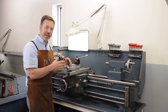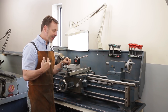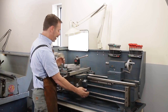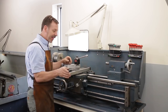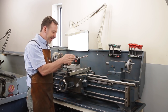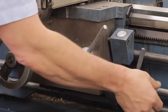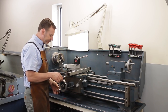Now, you want to check to make sure that these rods are not bent. It's really easy on these 2 rods because all you have to do is turn the lathe on, and you'll see if it's out of alignment. It'll show a lot of evidence. It'll be swinging out of balance. Same with this rod here. If it wasn't straight, it would be very obvious.